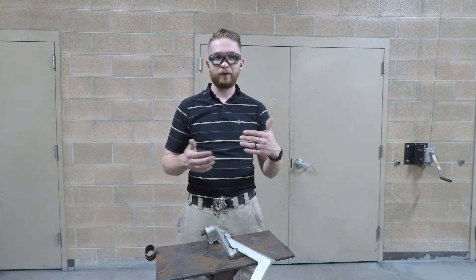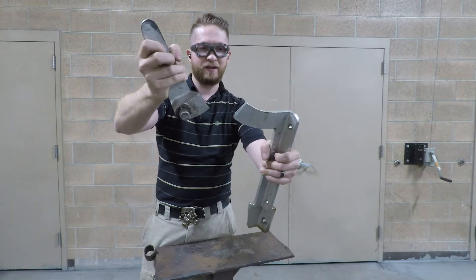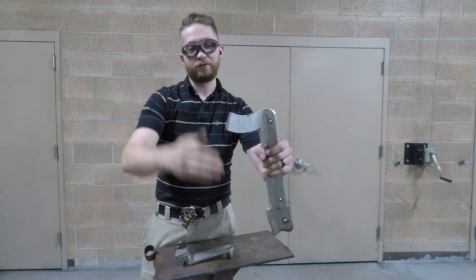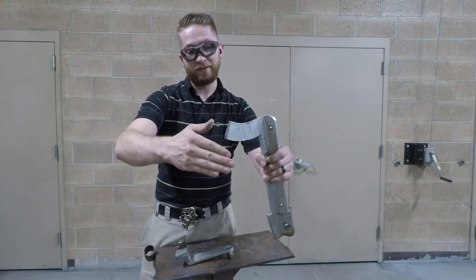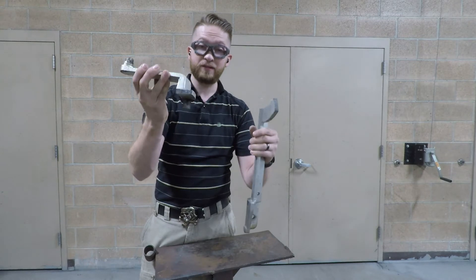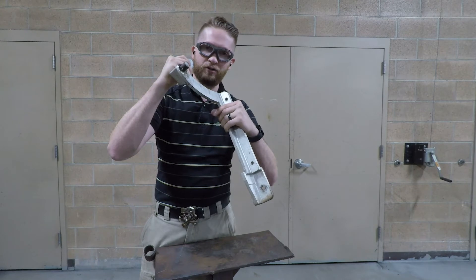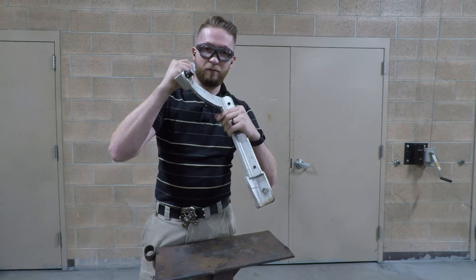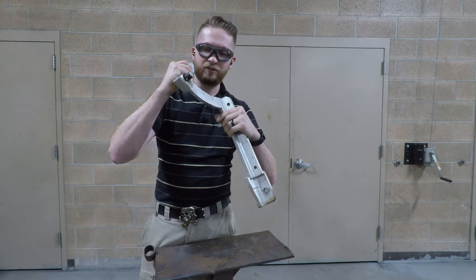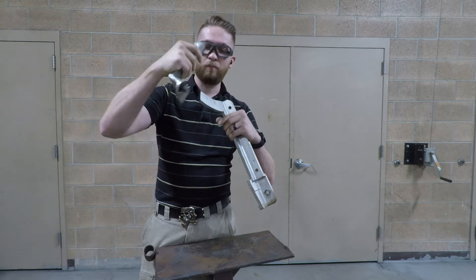I'm going to get my jacket and gloves on and start grinding away at this joint to make it more readily weldable. Right now we have a very clean broken line that's painted, so we're going to take that paint off. I'm going to put a double bevel — grind down this edge and then that edge on both pieces — so that when I meet them together there's a notch on both sides. That'll allow weld penetration with the nickel rod, giving it somewhere to seep down into the structure.